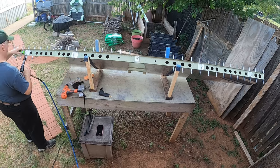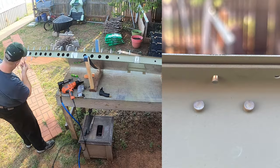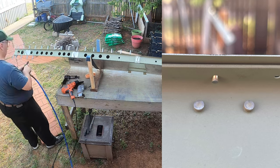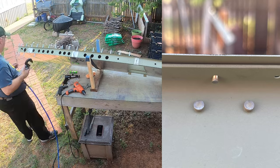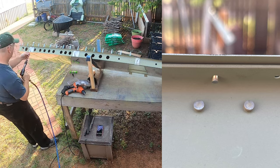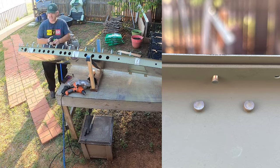I was getting some lazy rivets. And if you don't know what a lazy rivet looks like, this is it. Yeah, we see where it's not sitting quite right, and the shop head where you put the bucking bar against is actually kind of folded over. And I knew that, no, that's not the way it's supposed to be.